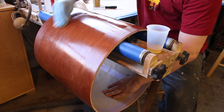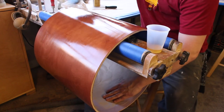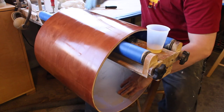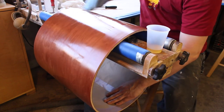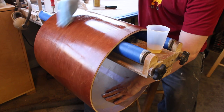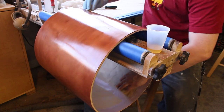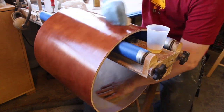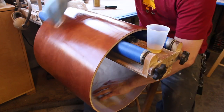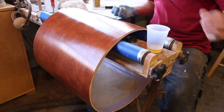The biggest trick with finishing for me is going fast enough to keep a wet edge so it doesn't get gummy - you're not pulling it all over the place. Don't go too heavy so you don't get drips. Then just trying to keep dust out of it really, which in a really big sawdust-infested wood shop, that's the hard part. I should mechanize these rollers - probably do it easily with a simple little belt and a power drill. Someday.